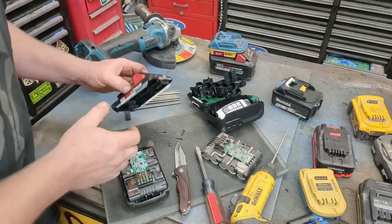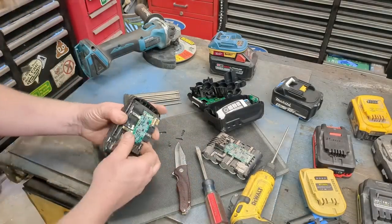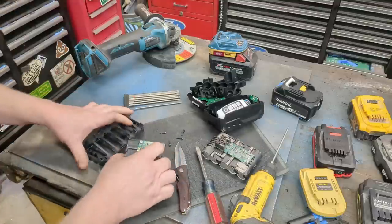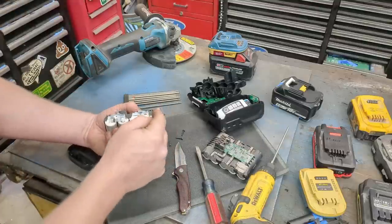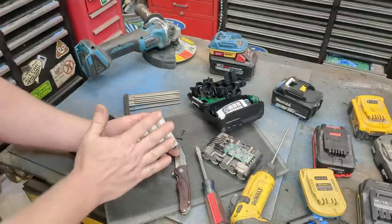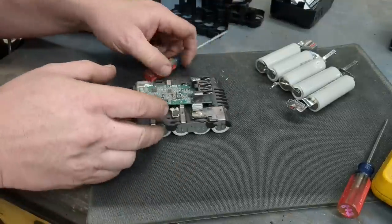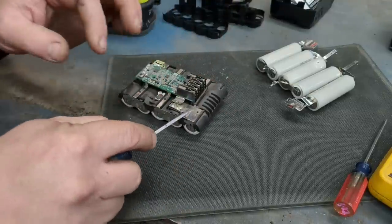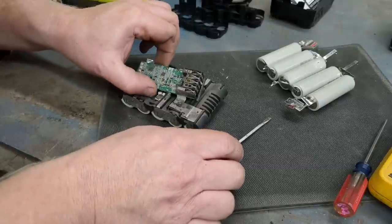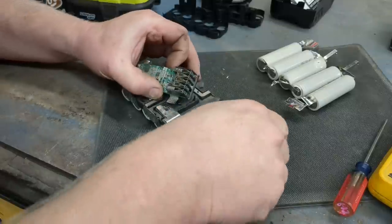There's the top of our Milwaukee going away. See you later. And we pop it out. There's our 21700 cells. Little silicone, just rubber bumper. And now I just need to take essentially these tabs off of here. This is 18/20 volts. 18 and 20 volts are the exact same. It's just marketing. I desoldered them, but I could have just cut them. And then my main positive was just tack welded on, and I just popped that off, and same with my negative. So now my board is loose, and I can actually pull my tabs off.